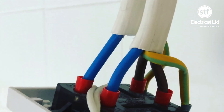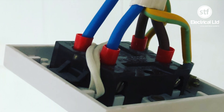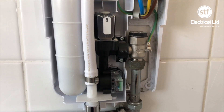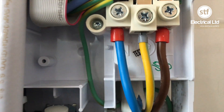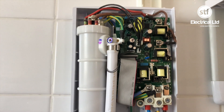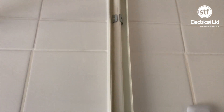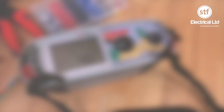You can see the shower pull switch — everything's ferrulated. Every time there are strands of cable at a termination, I ferrule them to get a nice solid connection. You can see I've done the same on the shower — cable coming down, ferrulated, with nice solid connections into the terminations. It goes up the back of the shower into the piece of MT4. Fire clips and cable restraints in there as well — only a small length of cable but good practice. A bit of MT4 all sealed in.